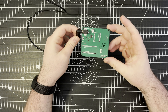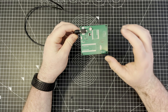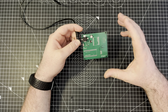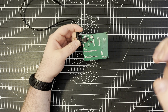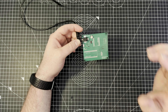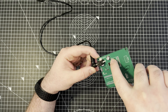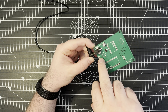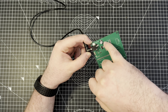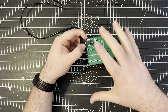We're back. I plugged it in and surprise surprise, it didn't work first time. There was one mistake — basically I made a silly mistake because I didn't understand the tools I was using properly, and it caused a short on the board. That was burning out one of the resistors, which was then affecting how the whole thing worked. It was basically a tiny trace bridging 12 volts with ground, frying one of these tiny resistors, which meant the whole thing wasn't working properly. Even when I split the trace to fix it, one resistor was burnt out, which meant this switching circuit was always on.